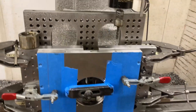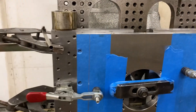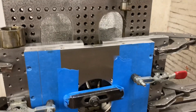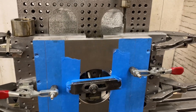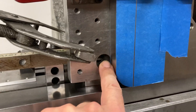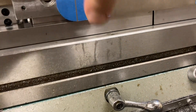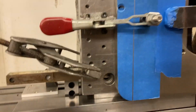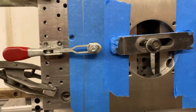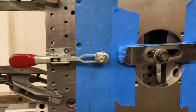It was a little combination — I had to try different things here and there. I've got these plates attached to the knee, sitting on those parallel risers to space it off the back some more. I could only use one hole in this plate right here. I've got tapped holes right here — that would be where I'd screw it to my vise. I drilled dual patterns on it so I can put those plates either way on the vise in either orientation. So I could only get one hole to line up, screwing this plate to that big knee in the back.